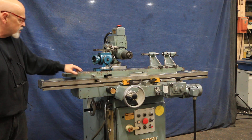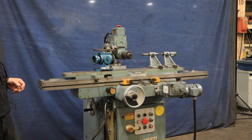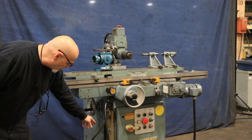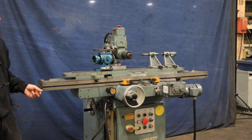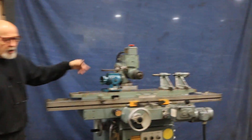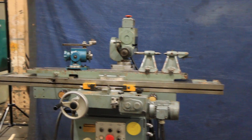Your upper table here has a sine bar set up and can also be swiveled. The machine has a port here if you were to have a motorized workhead, though we're not selling the machine with a motorized workhead at this point. The spindle can go clockwise or counterclockwise, as well as the workhead if one were provided.